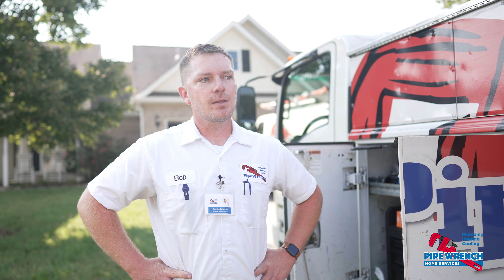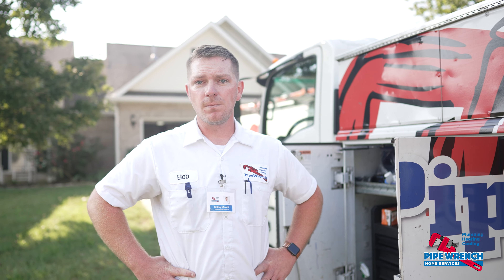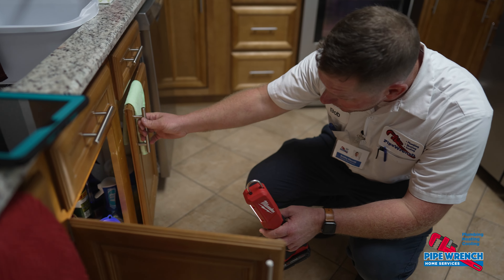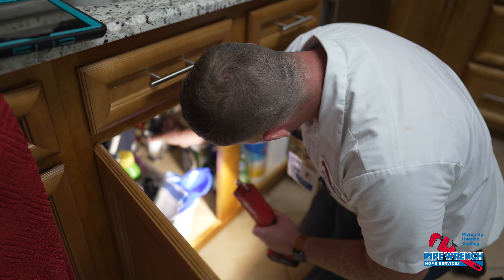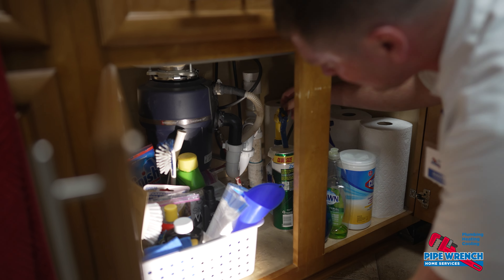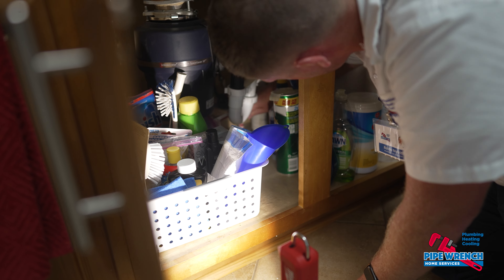Now that we're done with the flushing, we're gonna go through the customer's house, check all the toilets, check all the faucets, look under the sinks, make sure there's no leaks, make sure all the toilets are tight and secure, and check the bathtub. I like to make sure all the sinks and faucets are tight and secure — that one was not, so I'll tighten that up. We look under here and make sure there's no leaks, all the tubulars are tight, and make sure the emergency stops work.